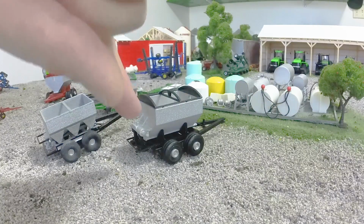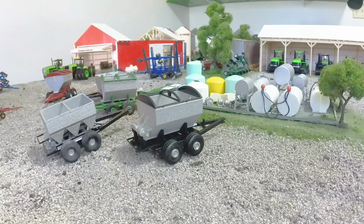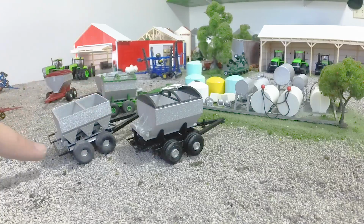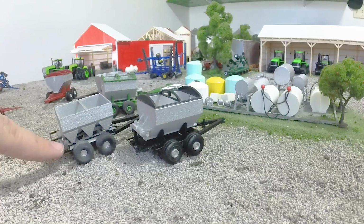The 6-ton, I also wanted to, so these are hydraulically driven. And so I wanted to put the hydraulic motor up here right where the beaters turn. And the idea being is, one, it's cleaner that way. Two, you have fewer components that way. You don't have to have two shafts to turn your beaters like you do on the 4-ton. The 4-ton, the hydraulic motor is down here, and so then you'd have a sort of chain drive sprocket here.